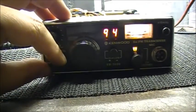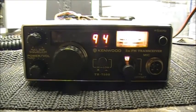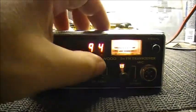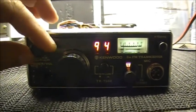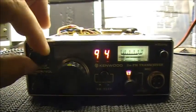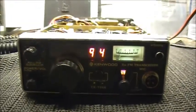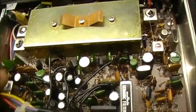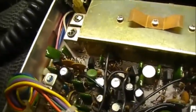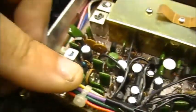This is video part two of the Kenwood TR-7500 and the non-squelch issue. I located a fix. Basically, with the radio facing this side up, you come on back to here, and your control for adjusting your squelch threshold is right here — this control right there, VR1.